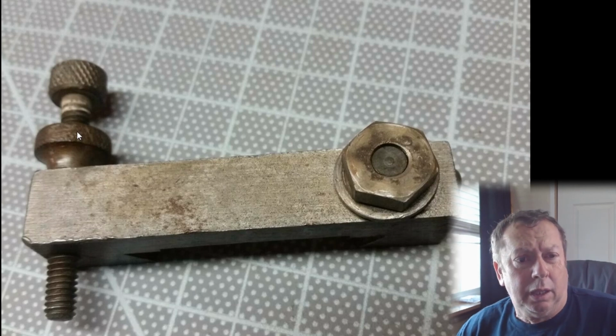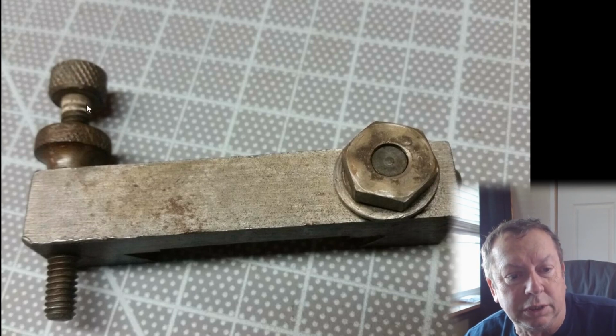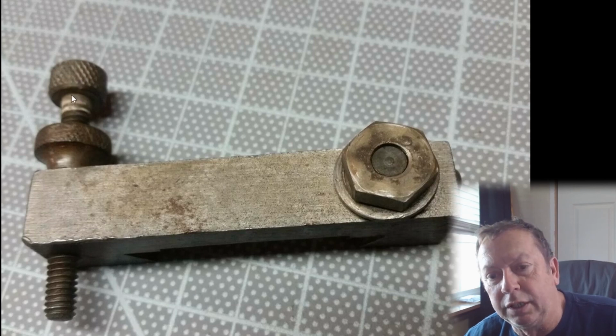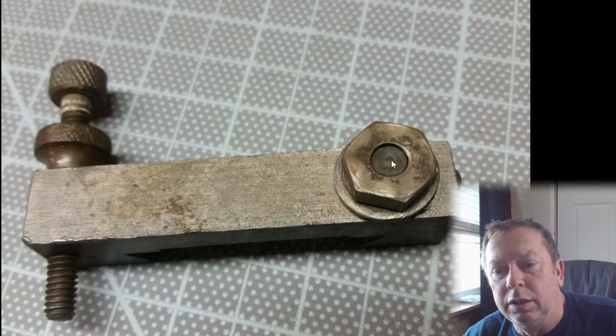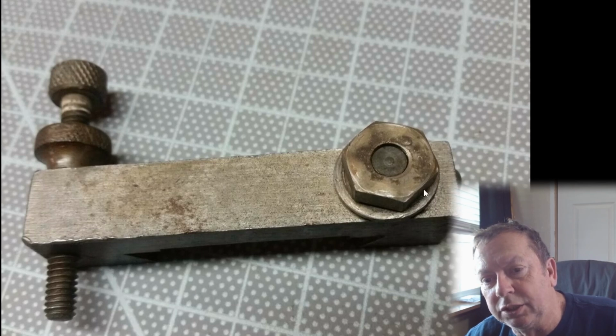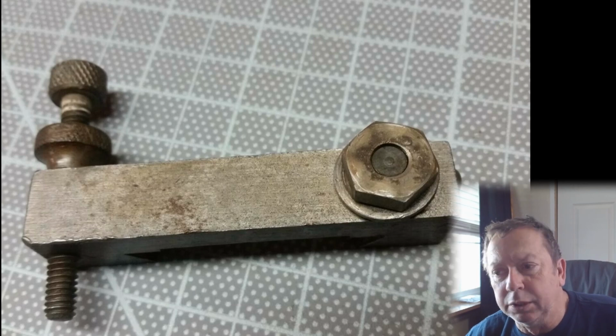And I think this little knurled knob is probably a custom knob. You can take a piece of ready rod, knurl you a little nut, and thread that right on there, whether it's Loctited, silver soldered, however you want to do it. Anyway, that's not a difficult thing on that end. I'm not sure if this is a 5/16 or a 3/8 threaded stud coming up through here. The dovetail is cut to match the one side of that. We've got a set screw locking it in position so it can't fall out and move itself around. But anyway, all the information you need to build it is here.